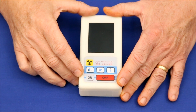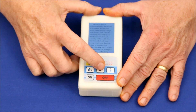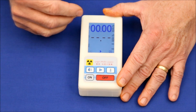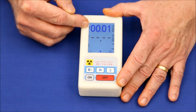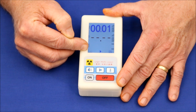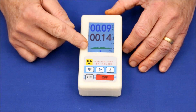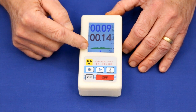To activate the detector, press the on button. And after the short page of explanation appears, press the forward arrow and the counter is activated. This blue number is the amount of radiation being detected in microsieverts, the international unit for radiation exposure. The green histogram, which will appear down here, shows the previous eight minutes and how the radiation level varied over time. Once the histogram has completed eight minutes of recording, a large red number appears here and this is the average value over that time.